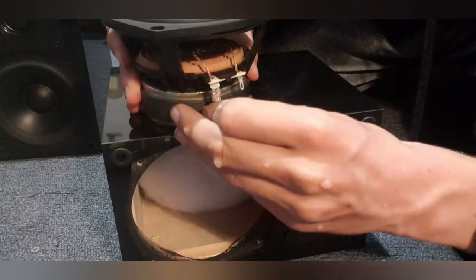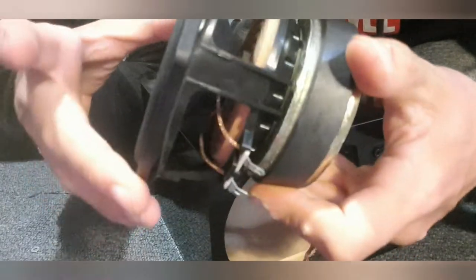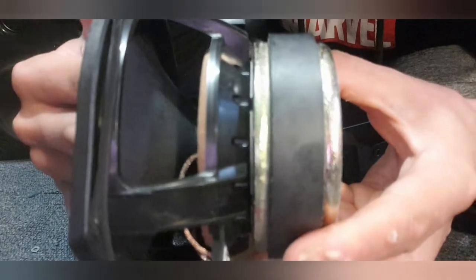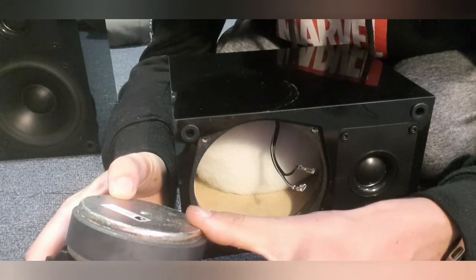Let's try and disconnect this plug here — just like that. You'll see the crossover in there as well. Here you have the woofer — it's a very, very nice four-inch woofer. The funny thing is it's actually plastic. It's got voice coil venting in there as well — you can't see the coil but it's definitely being cooled. These things sound really good actually. You've got the model IM.10B.